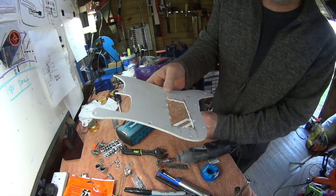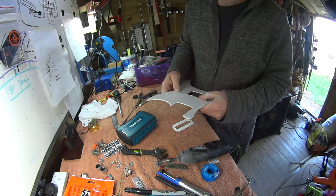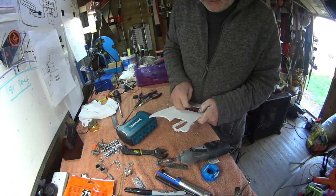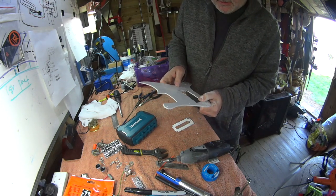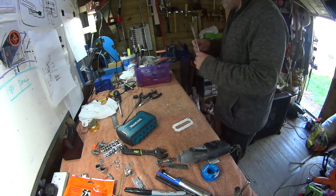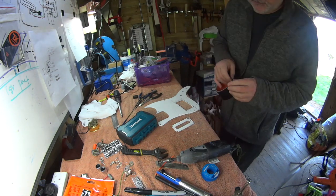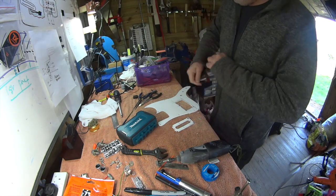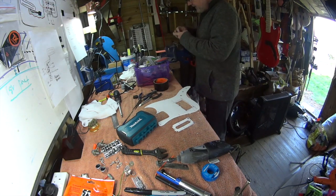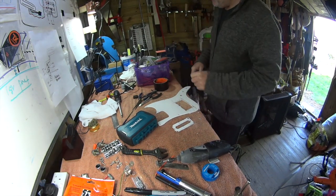The hole, as you can see, it's not a pretty sight to begin with. So there's a couple of things then to think about. We can either do a bit of Dremeling, or we can file it all. So to file it all, what I tend to do is put a bit of tape in the jaws of the vice, something like that. Temporary arrangement.